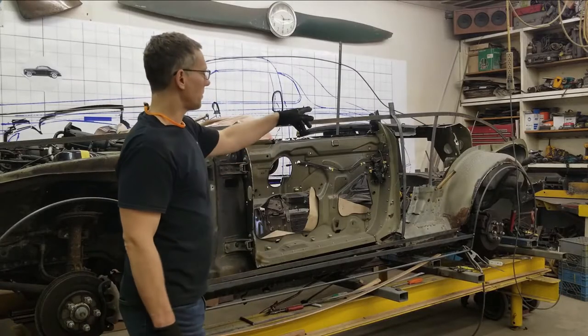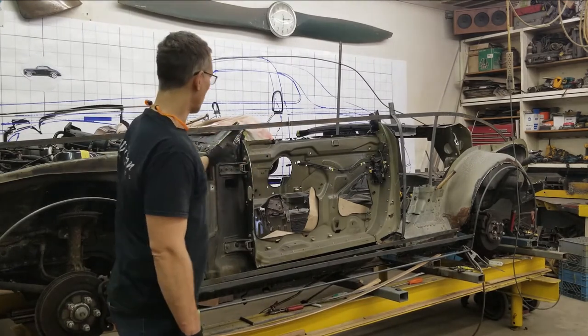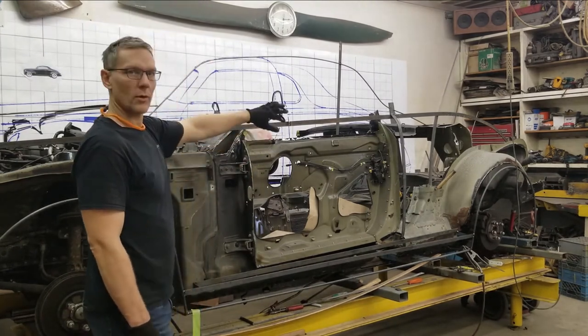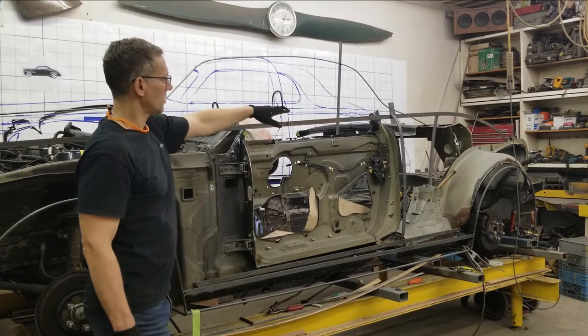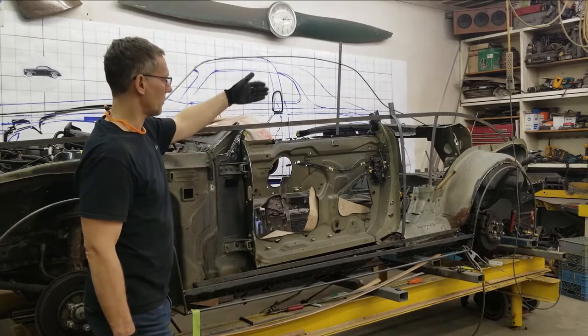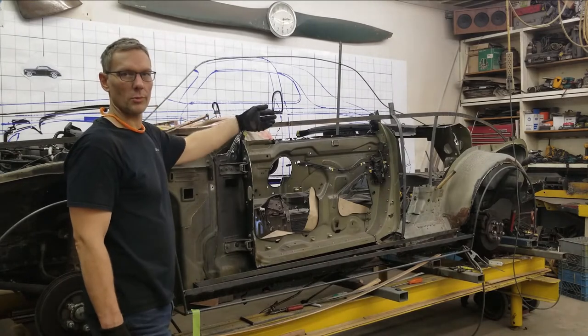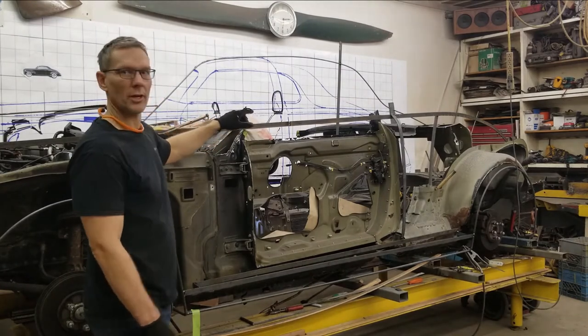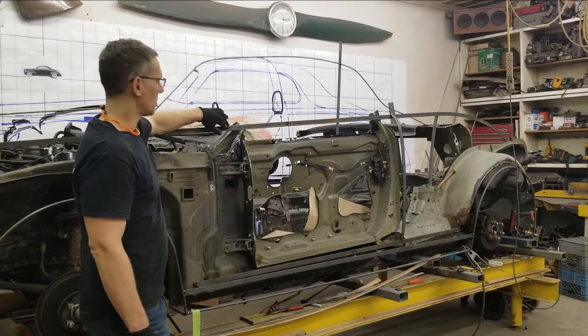Okay, so with the back B pillar established, or the flat bar established for the B pillar, we can now come to the front here. We created that outward curvature for the door and established that this is going to be the shoulder line. So we ended up placing the shoulder line inward, the 1¾ instead of out where we initially had it. You kind of have to work back and forth between the two planes just to establish all your lines. Now, since we moved that inward over there, this had to move in over here as well.